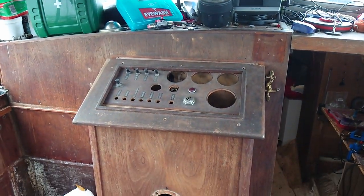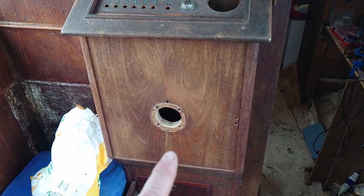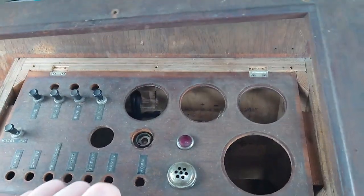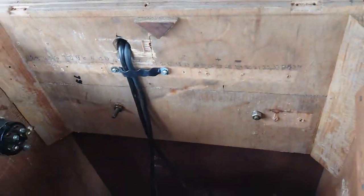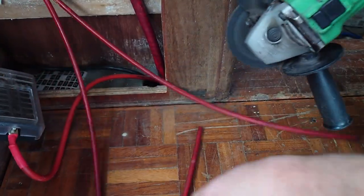Another thing we've done is removed the steering wheel, and if I take this to pieces — we've removed all the dials and got rid of all the mast controls and steering equipment that was in here previously. It was using Bowden cables and we're going to change to hydraulic steering. We haven't fitted that yet, but we're getting ready. And this massive slot, by the way, was a chain-driven autopilot — the chain went through that slot.